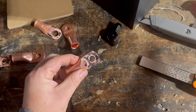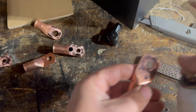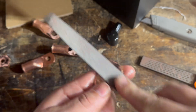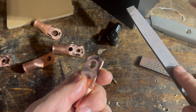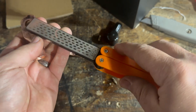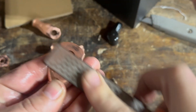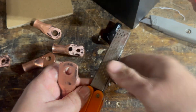Let's go ahead and take care of this one — I'll show you what we're going to do. Spray it with a little WD-40 or something; it's going to take off a lot of that stuff. You can use a combination of a file — that's working pretty good. You can kind of see the sheen there. I've also been playing around with using a diamond sharpening stone. Start on the 400 grit side and you can feel it really taking the material off. You can see how much is taken off; that's why I need to put a bit more lubricant on there.